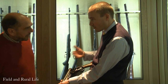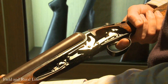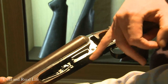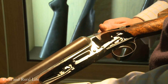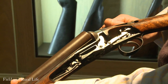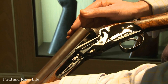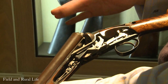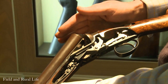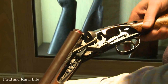It's really nice to see how the whole thing works. Safety off - you see all the safety mechanisms push forward. Pull the trigger, which kicks the sear out of the bent, fires the mechanism, the mainspring hits the cocking limb. As the gun is opened it resets the safety. It's the drop of the barrels - this famous patent of Anson and Deeley's - now re-cocking the gun. The gun is now cocked - you heard it click there - cocked before it ejects. And there's your ejector work, reset itself as well.